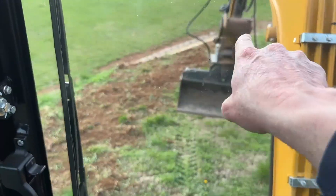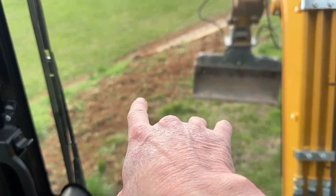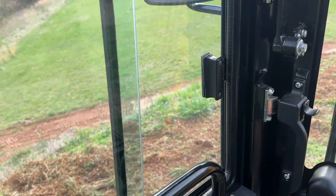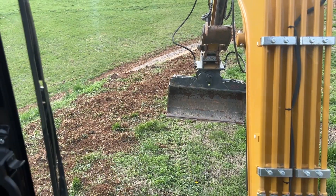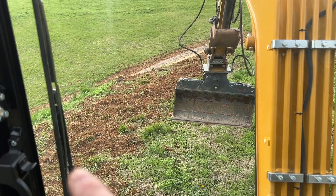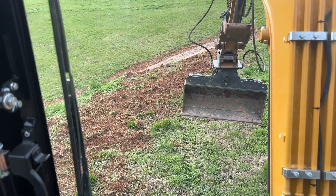We got a lot of that cleaned up - you can kind of see there I raked over the edge. I did the bank; as I moved, there was a little bit of a fill area I needed to get in there. Got in that and got that filled in as we backed up, trying to rake as much of the grass off. Most of the organics I just left laying on the bank. Now we're going to grab the LS without the shanks down and box blade this a time or two just to smooth it down and pull as many rocks out as we can. That should have this ready for seed - it's supposed to rain in the next day or two.